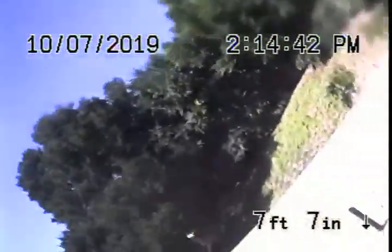We're now going to inspect the left-hand side of the house. Running the camera from the roof vent at the left-hand side of the house, we're down at the clean-out that we're going to continue the inspection from. The main line is still all ABS plastic, all in good condition.